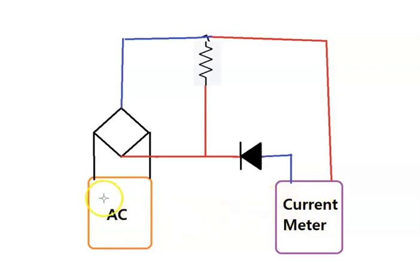This is the first circuit we're going to show on the bench. Here's an AC power supply as the one source. We're going to rectify it into direct current pulses, all one polarity — here's the positive lead, direct current coming out. The bridge rectifier has diodes in here, so current can't flow back into the positive; it only flows one way out. When alternating current pulses are coming out, they have a choice — they could go into this diode, but they're blocked. So they're forced up through a resistor first.